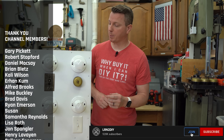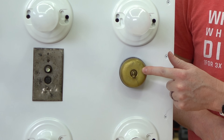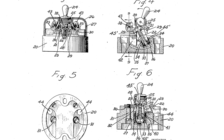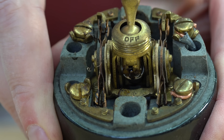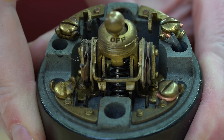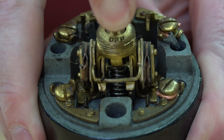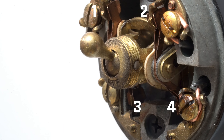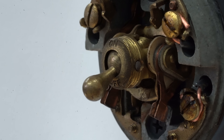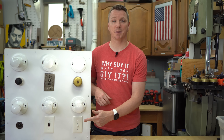Within about a year, one of the same guys who patented the push button light switch — William J. Newton — also patented the first toggle light switch. And with that, for the first time in history, lights could be turned on or off with the flick of a switch. Once again, the spring is the hero of our story. The toggle switch pulls on the spring and causes the entire mechanism to tilt in one direction or the other. When it goes one way, the four arms make connections with the four receiving pins, closing the circuit and turning the lights on. When you flip it the other way, they go away from the pins and the lights turn off. This is a brilliant and long-lasting design — so long that it's actually the same kind of thing that we use even today.